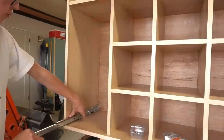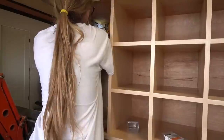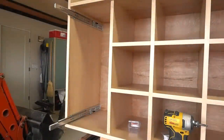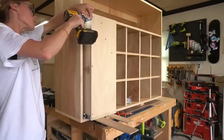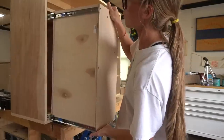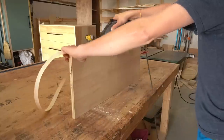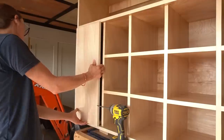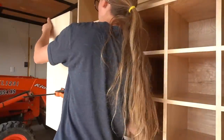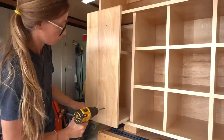Once the tie rack box was built, I installed slides into the large left cubby on the top cabinet — one at the top and one at the bottom — then installed the tie rack box onto those slides. I was pleasantly surprised that this worked as well as it did. I cut a plywood front to fit, edge-banded it, and screwed it on from the inside. After a little poly and a handle, it was ready to put together and photograph before sending it to my friend's house to be installed.